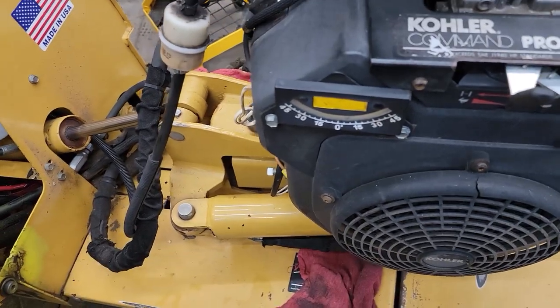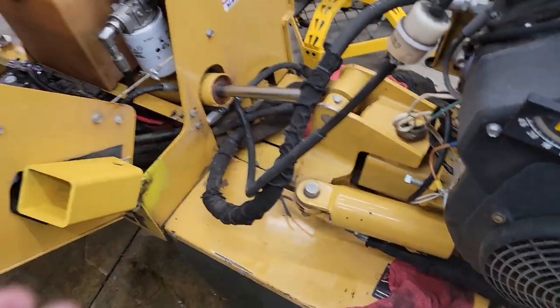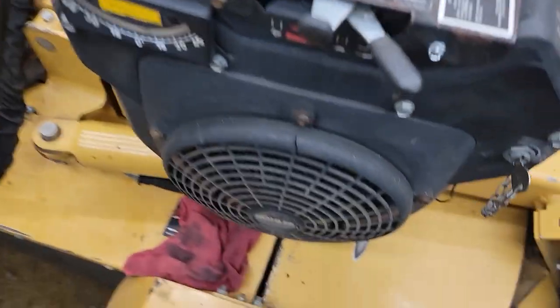And the oil, the most important thing is change the oil. And hydraulic fluid. When should you change the hydraulic fluid? At least in these machines, every season. Come wintertime, drain it all, put it in. The 5 gallons of hydraulic fluid costs me about anywhere from $35 to $50 at a farm supply place. It goes up and down with oil prices. But I always have some in case I break a line, so you should too.